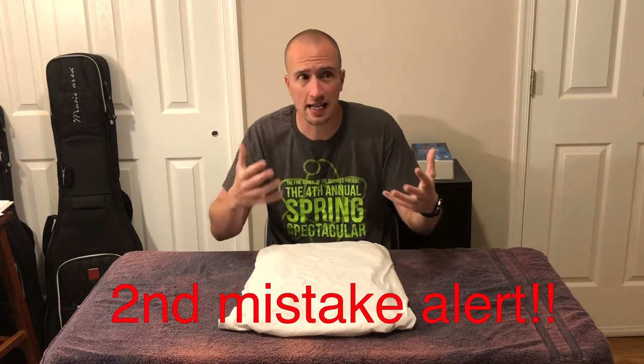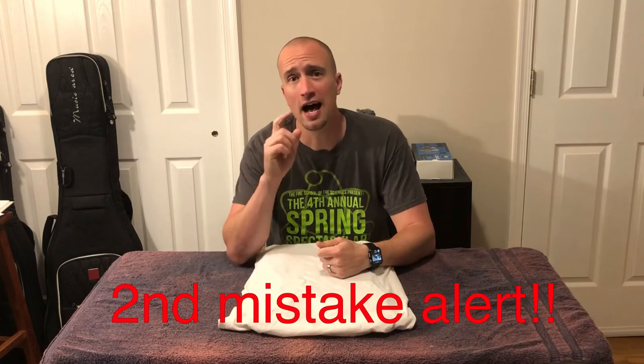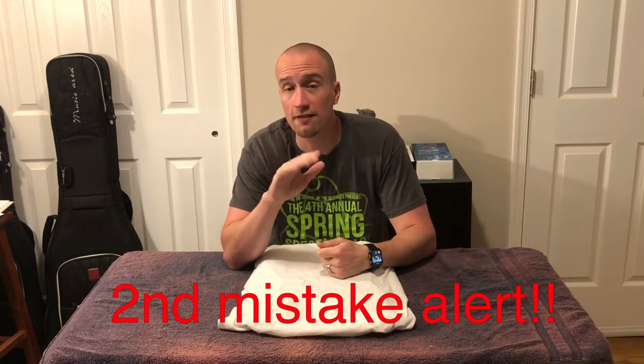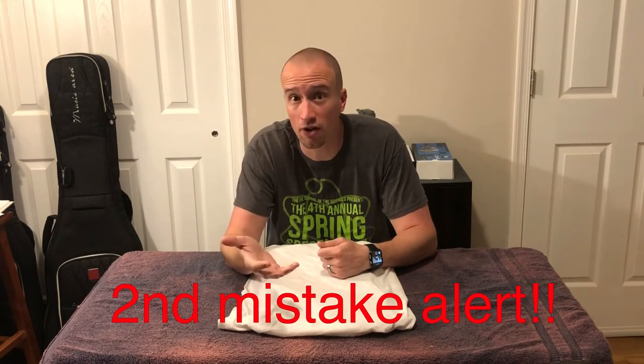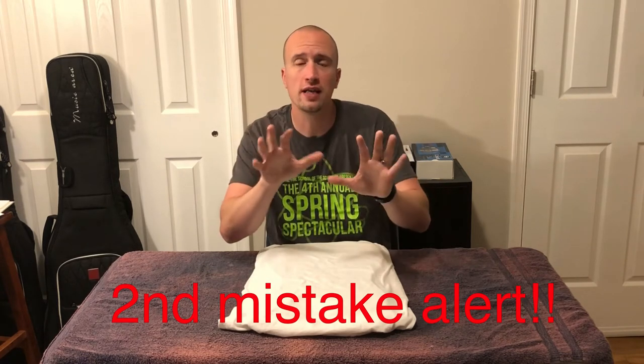In the moment, I knew I was filming and I kind of was stuck. I didn't want to stop, so I made a second mistake. I thought, well, if I just put enough paint on, I could use the paint to kind of flow into those nooks and crannies. If you're watching at home, feel free to go in the comments and tell everybody how bad of an idea that is. Paint is not a substitute for grain filler, but in the moment I decided I was going to try to do that.